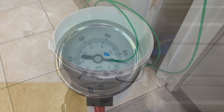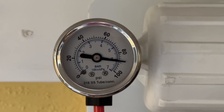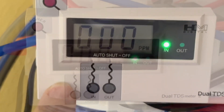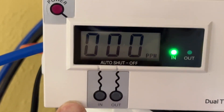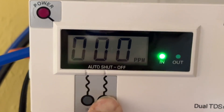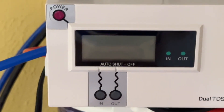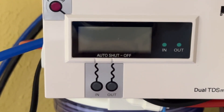Nice reminder noise — the bucket's full. Pressure is almost up to 90 psi. I just checked the TDS coming out of the RO — it said one, and now it says zero. That's before I even get to the DI stage, which would be the other half. So I'm definitely glad I changed the membrane out because it was coming out around six or eight before.